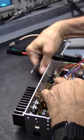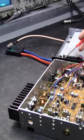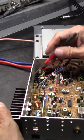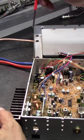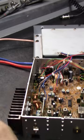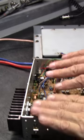This is a pain though. Replacing these, that's broken. It's not broken off the back of the board. Solder joints. The plastic is broken. You can see that. See it missing? Broken? On these radios, it gets even worse because you just can't unsolder that, take it out, and stick another one in, due to the part of the housing of this jack for the external speaker. Because it's insulated from ground, the plastic sticks out the back of the hole. So you just can't stick one straight down because it doesn't fit that way. So you gotta remove either the entire board or one side of it. The best way is to remove the board. That's the pain in the ass about replacing these. The best way, so you don't put any kind of stress on any other component, is you gotta remove the board. It goes in a certain way, it comes out a certain way.